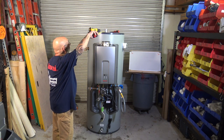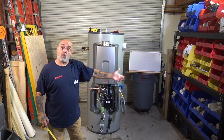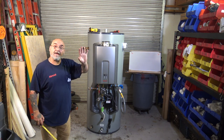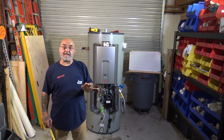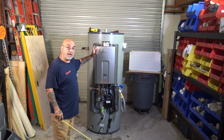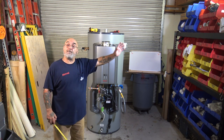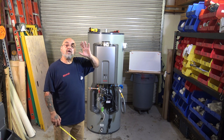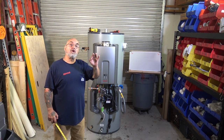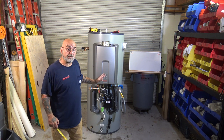Then at the top of the unit, right here, dead center, is an inch and a half hot out. So you'll take your cold water, bring it in, take your hot water, bring it out. Now we'll go over some piping. If you want a piping diagram for either just a basic cold in, hot out, where you're going to set this at, say, 120, or you're in a commercial building where you need 140, you have to put a mixing valve, in the description below will be my email. Email me and I will email you a drawing of what you need, including multiple units.